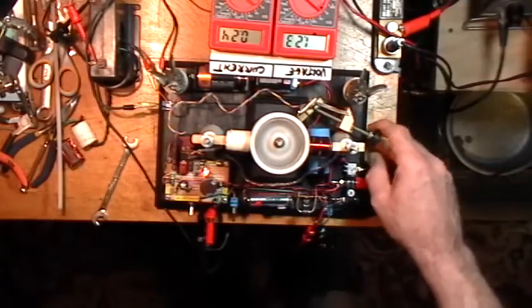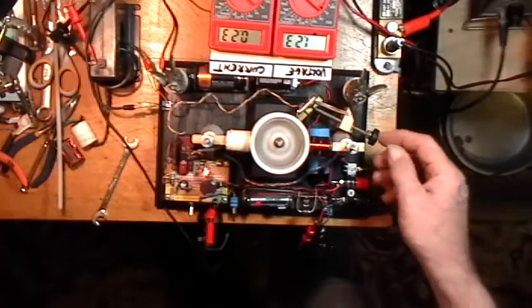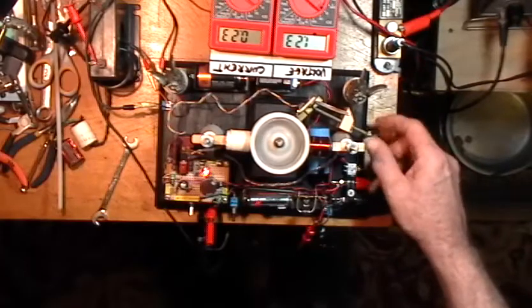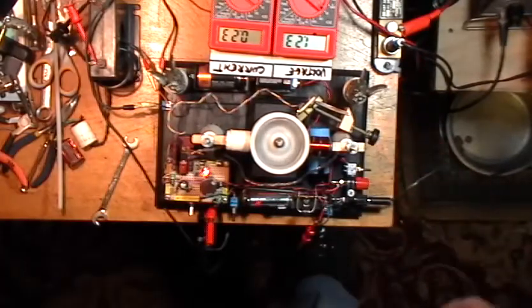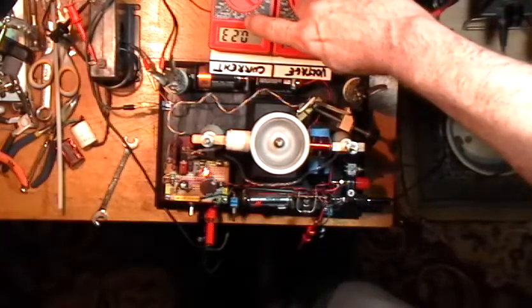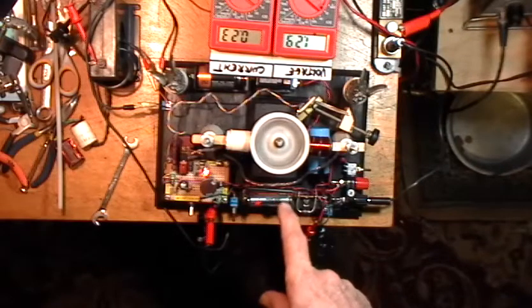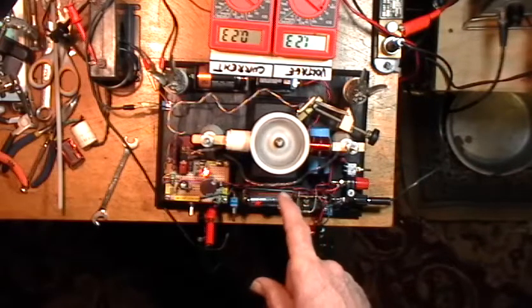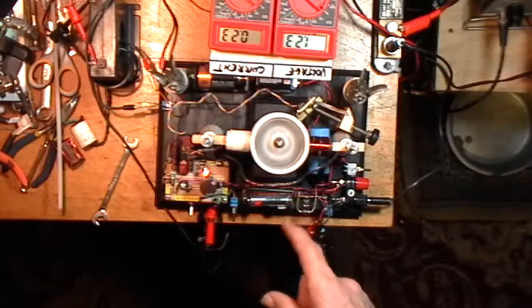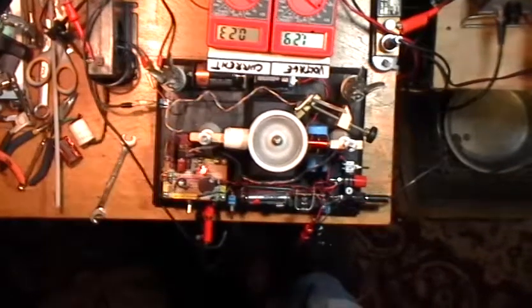If I have it timed just right it'll really go fast with those coils set exactly in the center. We're still on 1.23 volts and 230 milliamps input, and the counter says we're passing through 69 Hz right now — times 15 is the RPM. Thanks a lot.